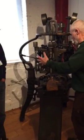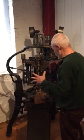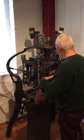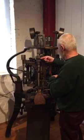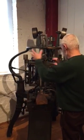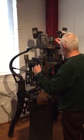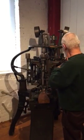There are five cutting stations. There's this pentagonal turret here. You unlock things by shifting a lever here, and the belt pops up from here onto this one. Then you turn the turret to the next station, move the other lever, and the belt pops back down onto the next pulley.